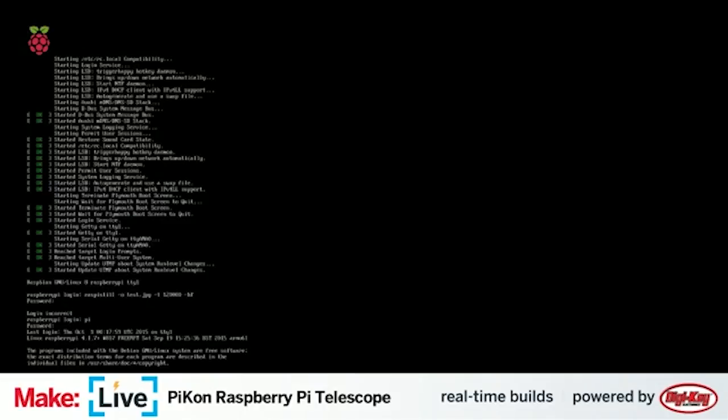I was so excited to get this thing running and looking out the window that I started typing in the command that will show us the output of the camera before I'd even logged in yet. To really just run this, we're running the Raspberry Pi camera capture command, which is raspistill. Probably don't need to capture the image into a file, but we're also going to do dash t and then set the number of milliseconds we want it to preview for. I think this is going to show for a good solid 2 minutes.